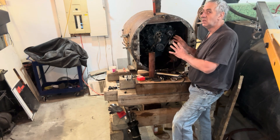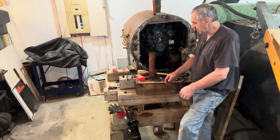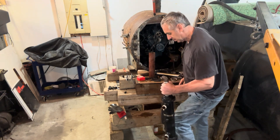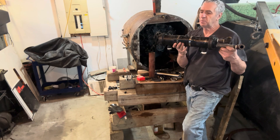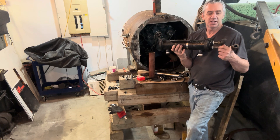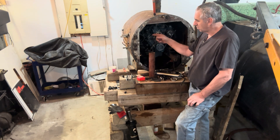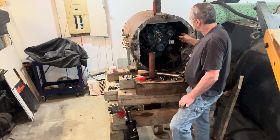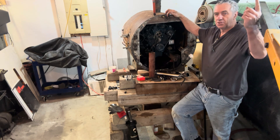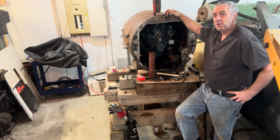I'm pretty pleased with the whole switch to this little engine — I just have so much more room to work with in there. This is the heat exchanger, and according to ChatGPT it's sized just right; it doesn't have a whole lot of room to spare in terms of cooling ability, but it's definitely sufficient to cool the engine. The water flows in, goes through the heat exchanger, then through the exhaust, leaves out the top right here, then out through the hull to cool the exhaust valve that's outside the hull.